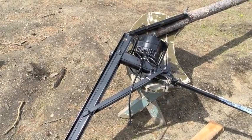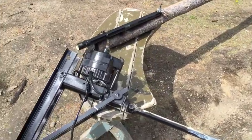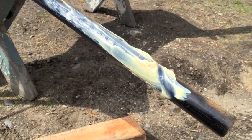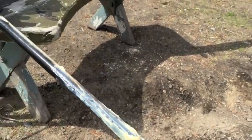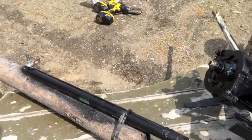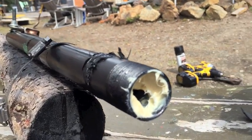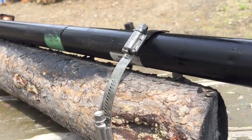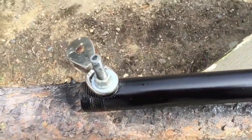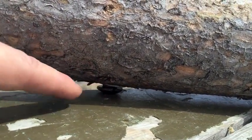So I gave the wind turbine a coat of black paint - wouldn't hurt if I blasted it a couple more times. And then I put some grease down on the bottom here, on the shaft - the 1-inch shaft. Now the 1-inch shaft fits nicely inside the water pipe I got here. There's more grease inside. Just got a hose clamp there, and I put a bolt right through underneath there.